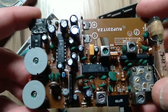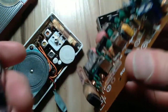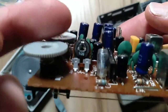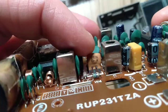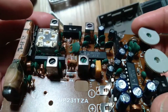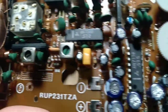What I like about the 1985 model is that it seems to me to really be a hybrid of digital signal processing and analog components. There's even, on this one, a variable resistor — I don't really think I've seen too many of these around. Variable resistors can change the current and voltage in a circuit. See that — the 103? That is a ceramic FM filter; notice the red dot. Perhaps someone could offer in the comments why we have the red dot there, as well as these black dots on some of these capacitors — they're not on all the capacitors, just on all the green ones.